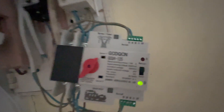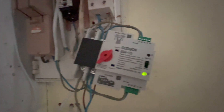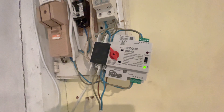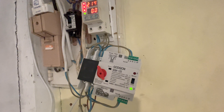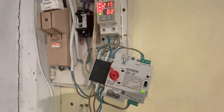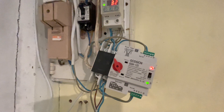That's not so good — it was supposed to change over because the inverter is there. I'm in manual mode, so I have to turn it back. Now let's put it into auto mode — that's what should happen. It's in auto mode, and we've reinstated the mains. So when that mains comes back and you see A illuminated, it should change back automatically. If it doesn't change back automatically you end up staying on your inverter power.